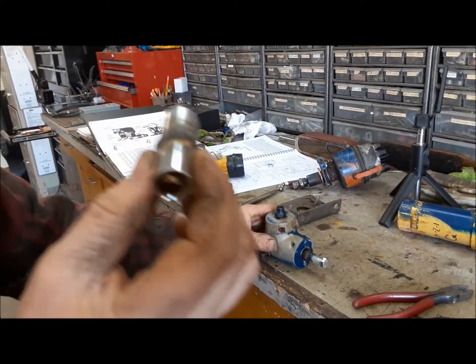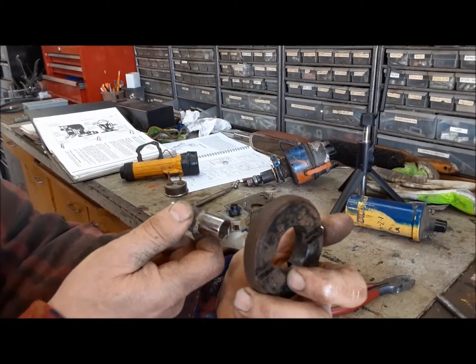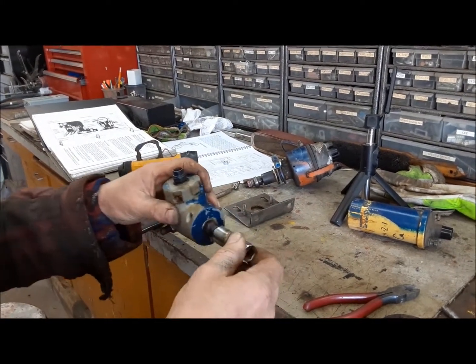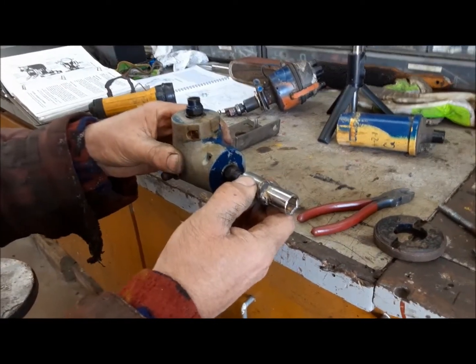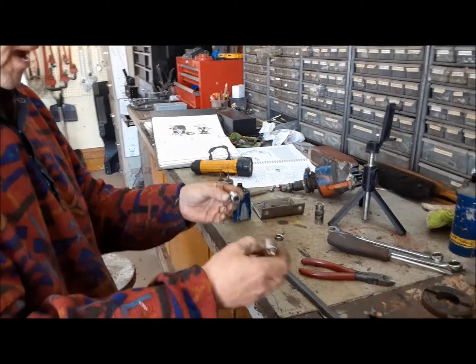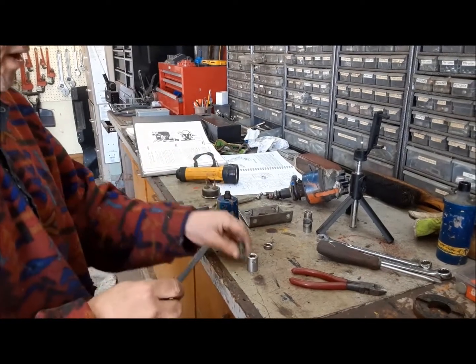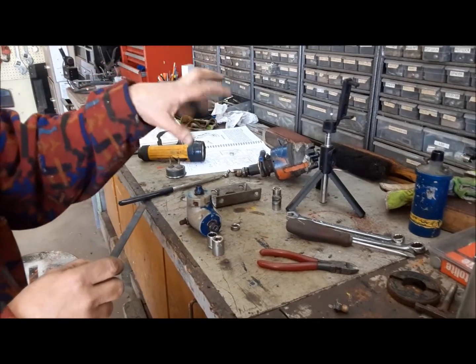In its new incarnation, I've got a 9/16ths and a half-inch socket welded together, because there's a 5/16ths nut that holds the drive dog for this disc onto the engine. The way it turns, it won't loosen it, so we're good. We're going to put that in there as a drive coupling — it'll be a lot more stable. I'm also connecting a half-inch and a 5/8ths socket back-to-back with a piece of 3/8ths square rod to make an even shorter drive coupling that'll allow this to get closer into that housing and buy us more room for the distributor.